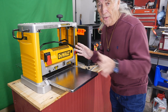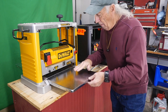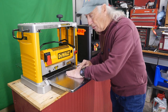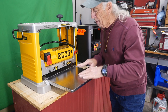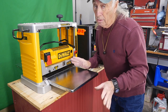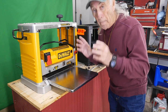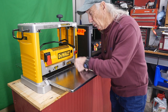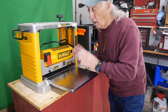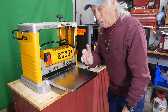This is the number one complaint about the DeWalt that I'd heard about before even getting this machine in. I've suffered it many times — the steel plate has a tendency to cause the wood to stick and hang up in the middle of going through the planer, which makes a mess. I was running hardwood through this a couple of weeks ago and every piece I had to use a stick to push through because it kept sticking. The contractors all had the same complaint and I've never been real happy about it.